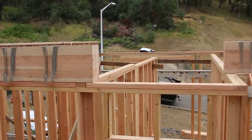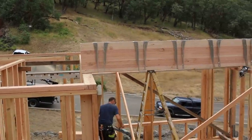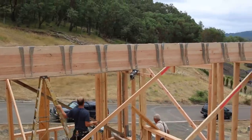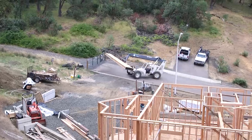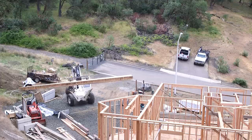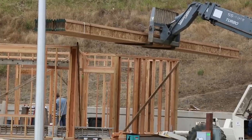The plans make it very clear where these beams go and what size they need to be. The plans don't tell you exactly where to attach the joists, but it's easy enough to figure out the layout because the spacing is specified on the plans, and there's really only one way to make that two-foot spacing work.